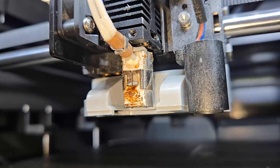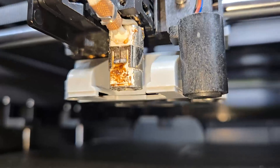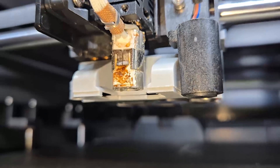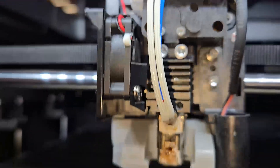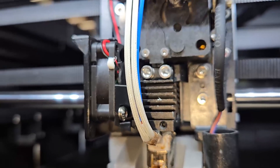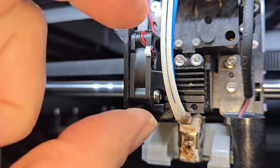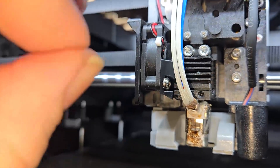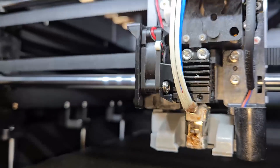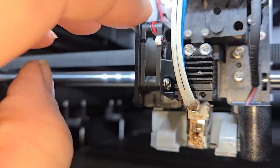I could do without the one week downtime, but what alternative do you really have at this point? While I'm at it, I downloaded an improved heat shroud and also a sort of shroud box — two different downloads from Thingiverse. I'm going to do the box; it just slips in front. You have to disconnect this wiring, move it out of the way, carefully insert, and that's it. That one's brilliant. It gathers the airflow into a tight little area and is able to go through outside — it's better focused airflow for this fan.